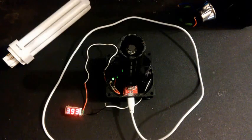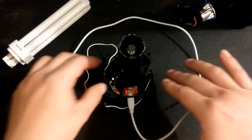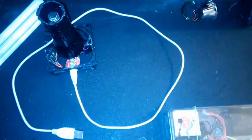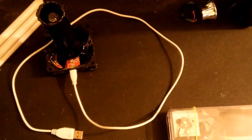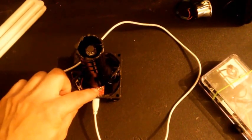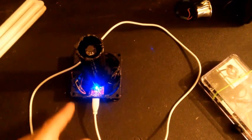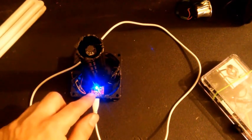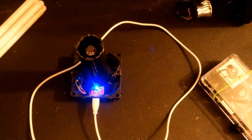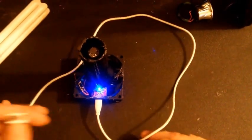You really have to go by the voltage drop. When the circuit is run down — which you can actually tell with these USB little driver boards — this particular one has a button you have to press first to engage the USB output. So if I wanted to use this to put some charge on my phone, I'd have to hit that button first and then it'll engage the output. It's got these little red blinking lights, and when it's solid red that lets you know it's full. These blinking lights ramp down depending on the voltage.